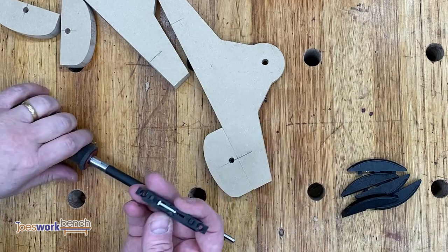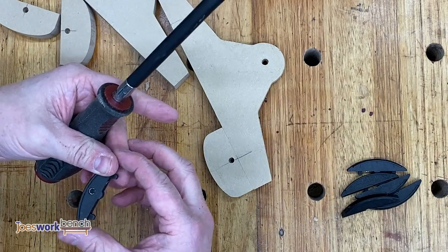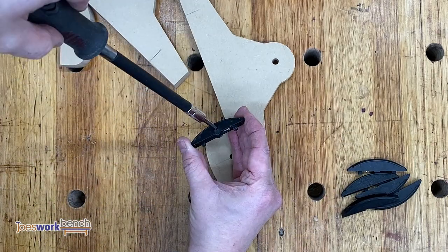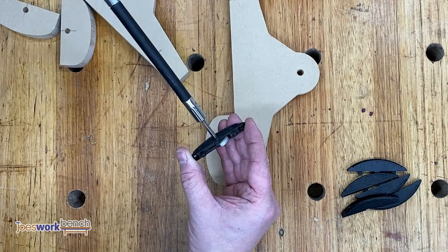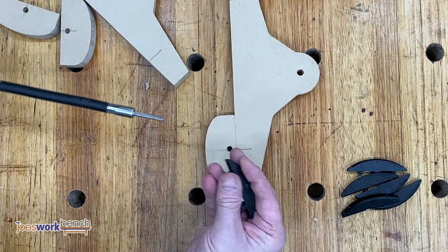Lamello's Zeta connectors are very similar to biscuits, but they are held together with a small metal locking arm. This arm is twisted to lock it in place with an Allen key. This locking arm makes it perfect for this project.